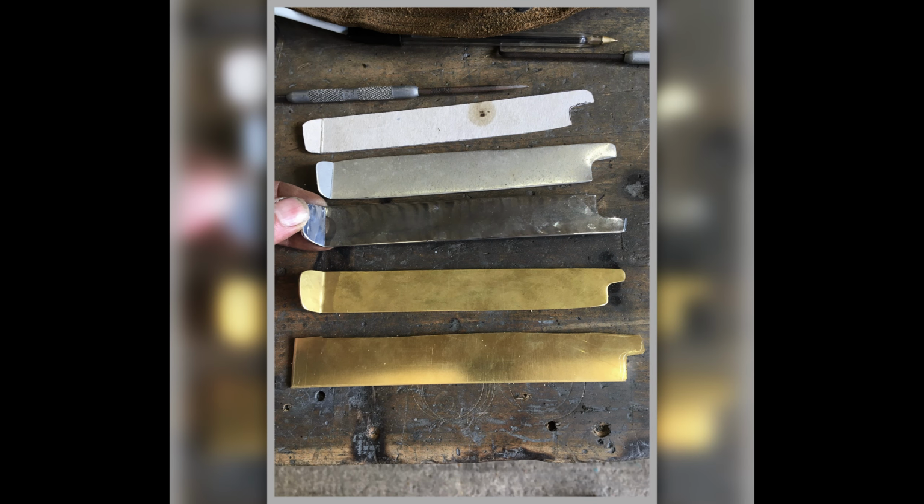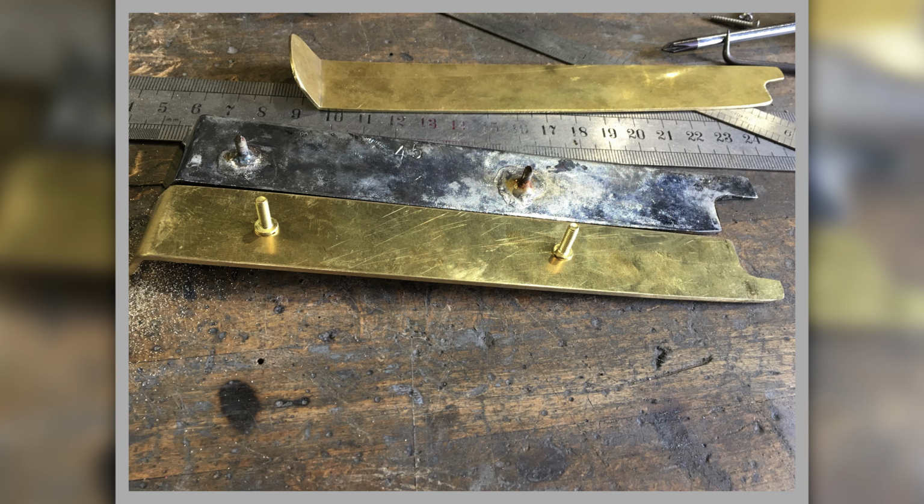These are the little trims that go up on the top of the door by where the quarter light opens. Now we had one side, but we're missing the one for the other, so I was making some test pieces and, you know, trying to see what we got. There's one made, and then I bought these little brass screws in, and then took the tops of them off a bit, and then I got to silver solder them on.